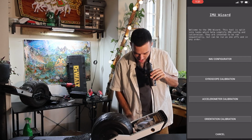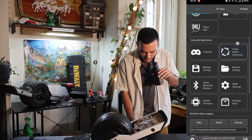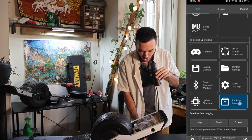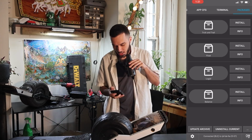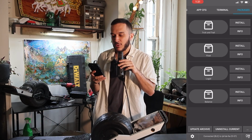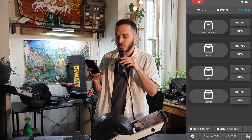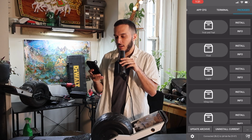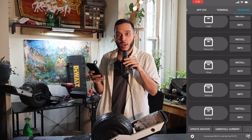We're going to go ahead and press cancel now. Cancel isn't canceling anything, it's just getting out of the wizard. And we are going to float all the way over to packages. Press on packages, and if you only see the 4 that I see here and you don't see something called refloat, go ahead and press update archive, and we should get refloat. Go ahead and install that.